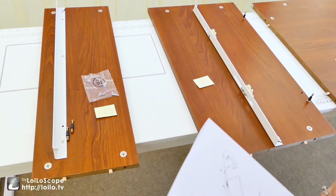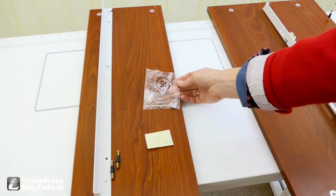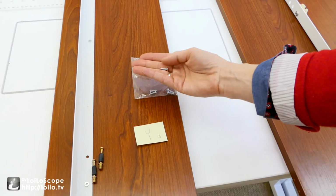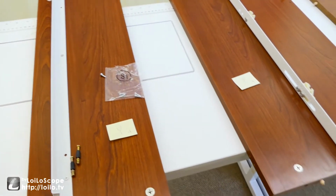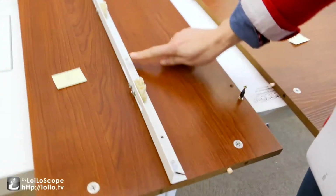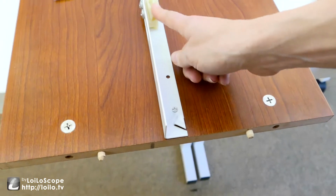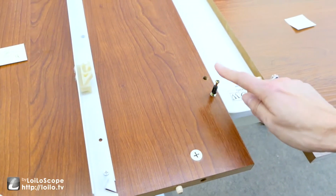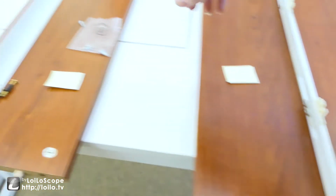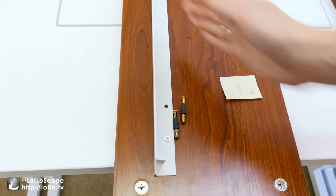On steps 2 and 3, you're going to find your Z and your Y panels and grab your remaining S1 screws, which are the little silver screws, and your left and your right rail. And you're going to place your right rail onto your Z panel, screwing into the pre-drilled holes with your S1 screws. Kind of notice placement here. The plastic piece is facing towards the cam bolt here and the holes. And then on your Y2 piece, the cams are facing here and the inside is here.